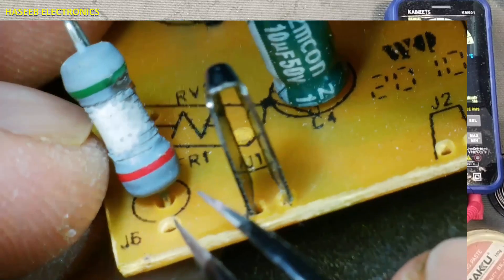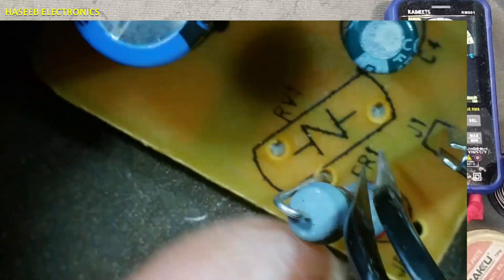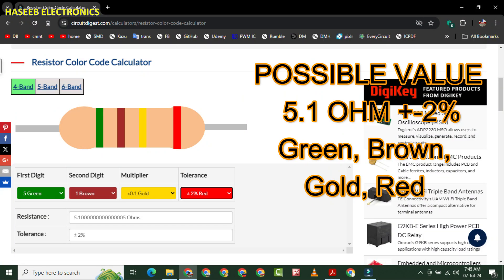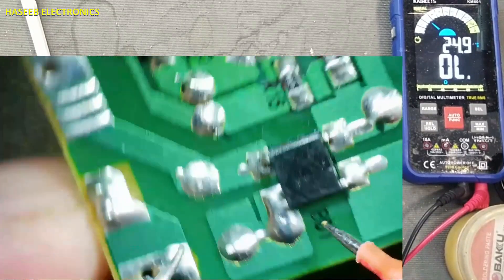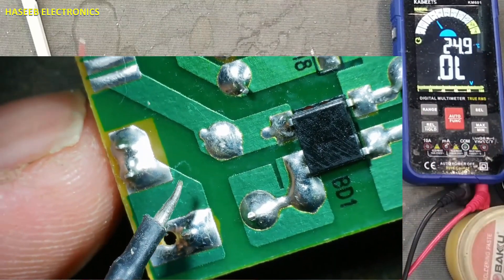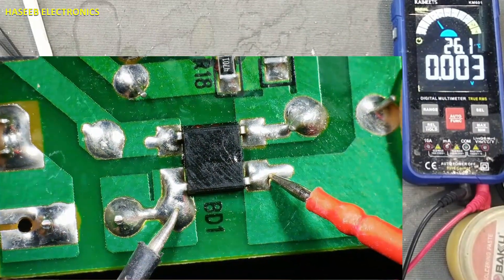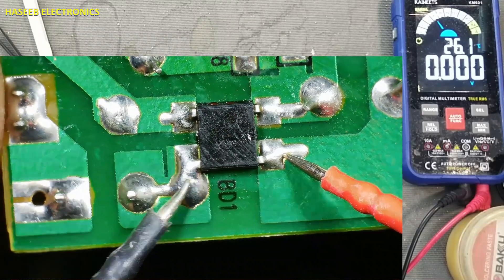This one and this one are the input terminals. At this terminal there is a fuse resistor — it is FR1. Fuse is open circuit. Then set to diode mode. Here is the positive output terminal, and it is short circuit with the input terminal.